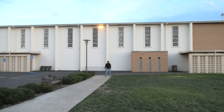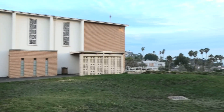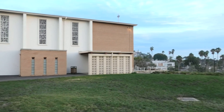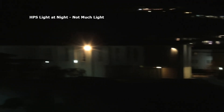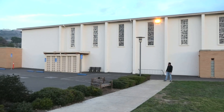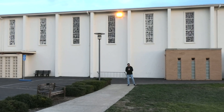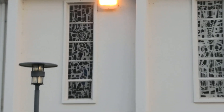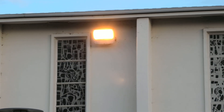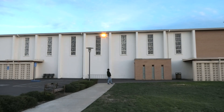We're showing you some more of the lights on the building here at the church. We've got a 400 watt — or what we believe is a 400 watt — HPS floodlight up on the wall, with some smaller ones up in the corner. We're going to be replacing all these and kicking up the light. It's nighttime so you can't really see much out here. We're going with some 300 watt lights, and may set up motion sensors to manage some dimming if they want to bring the light levels down. We're going to have a lot more light with a stronger fixture replacing these.